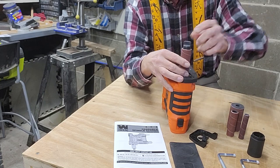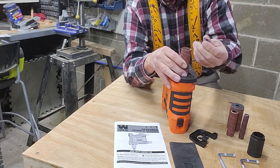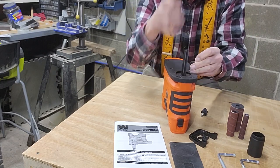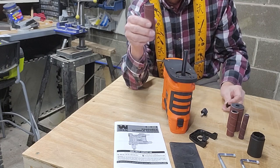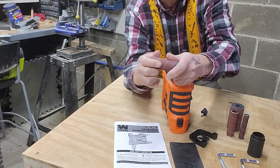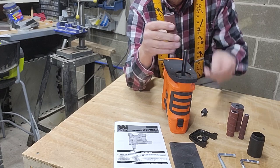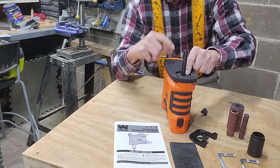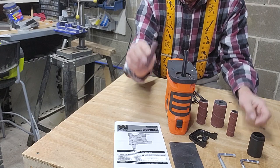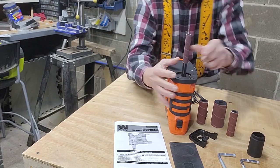The thing it has that I really like — the others I've seen, you have to have a screwdriver or a wrench to take this off. That's how you take the spindle apart. Main thing to remember is you're going to have a top washer and a washer underneath, and the drum compresses — that's what keeps the sandpaper on the drum itself. When you pull that out, both washers have a tendency to stick, so make sure the small washer goes on top and the big washer goes inside. The smallest spindle does not have a drum because it slides right on the shaft, so you don't have to worry about that.